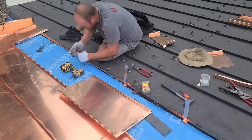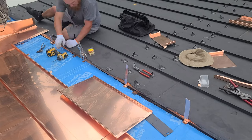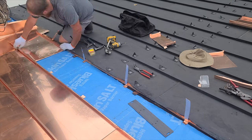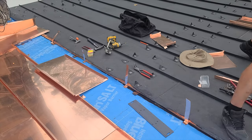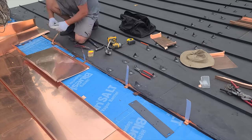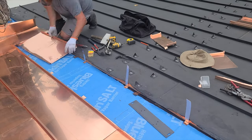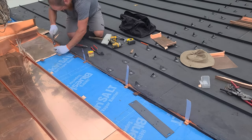You can see the remaining roof to be covered is exactly the width of the panel, and that is because we were able to split a sheet exactly in half and have the panels work out to the same dimension as the previous panels — but with a mechanical lock standing seam instead of a single lock standing seam.